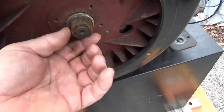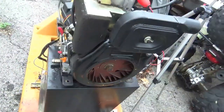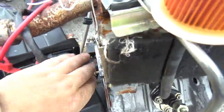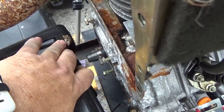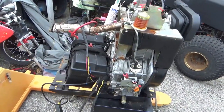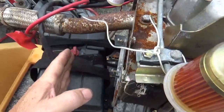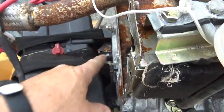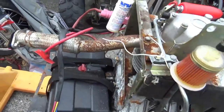Some of these you're able to hook up from the front — you'd have to come up with some kind of pulley system running off the front of this. Hopefully the front bearing is strong enough to drive something from there. The drive shaft is a bit stubby and it is tapered. What do-it-yourselfers tend to do is keep the rest of the generator, cut the piece off that tapers and slides in, leave a little extra shaft on it, then create a cage with those bolts and put in an outboard bearing.